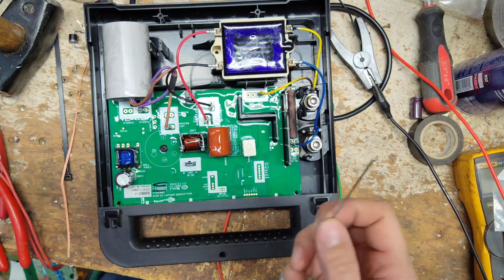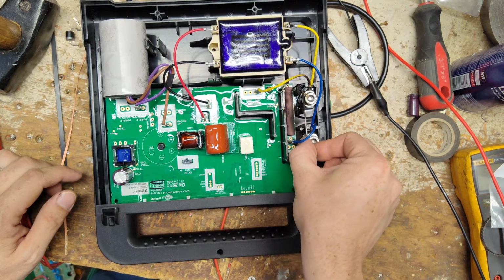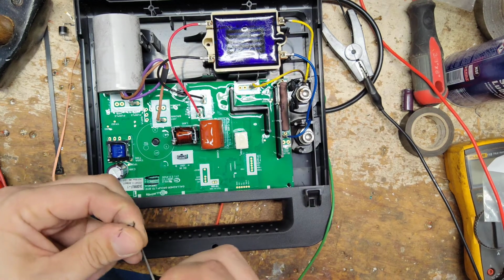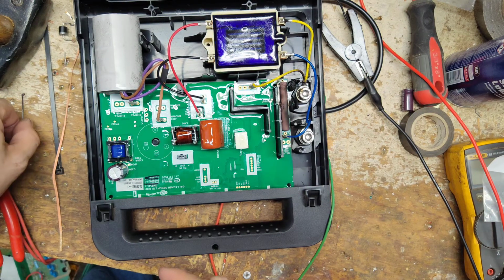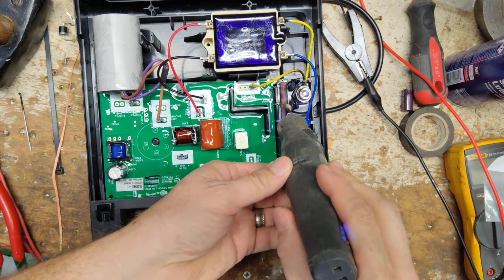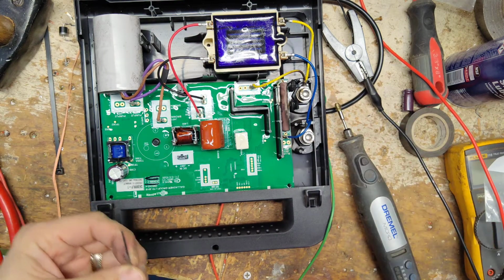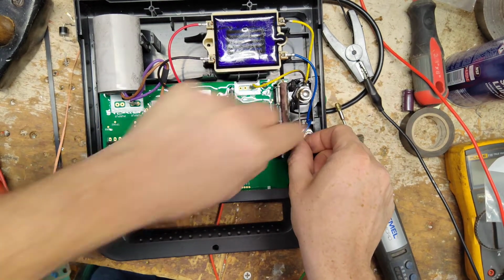I imagine what happened, either lightning did get a hold of it, or it got bumped and it had been arcing. It was rested up right against the bolt there, shooting an arc across there. It got so hot from it arcing that it melted that plastic, because it's supposed to sit right there. Huh. And see, the little rod they use for spark gap lightning stuff is all burnt up. And I imagine it's been doing it for a while, because I don't think that would happen right away. I think it would have taken some time to get that burnt and black. Yeah, it's supposed to sit.